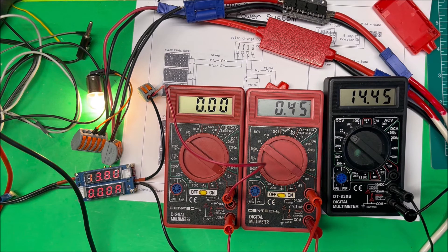These are rated at 80 amps, but you can't run 80 amps without a bigger heat sink. At 40 amps they seem to work fine, and I don't run 40 amps all the time. I use this for my TV, charging my laptop and cell phones, and my workbench for my scope and other things — not much load. These things work, come in a nice package, and are easy to use. I've had this one hooked up for about three years with no issues. Just don't try to run them at 80 amps — they'll get too hot and probably melt the plastic. That's diode switching on my solar panel system.